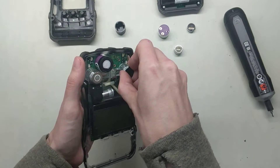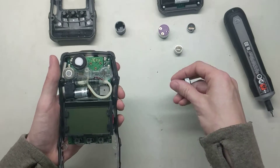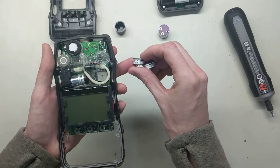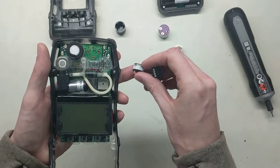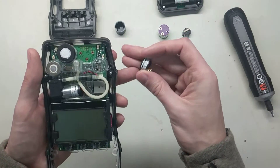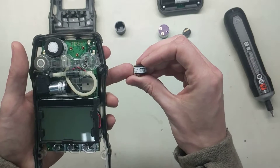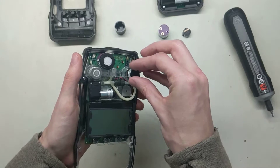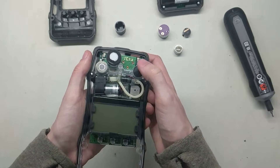Here's your CO/H2S right here. If you're going to replace that, we would take this one out, check it over, and pop the new one in. The last three-digit code on the label is going to be your date code, so you're going to pay attention to that. Depending on which sticker you've got, some of them might read a little bit differently, but you can usually find that three-digit code somewhere on there. Pretty easy — just line up the four pins, pop them in, snap it in, and it's good.